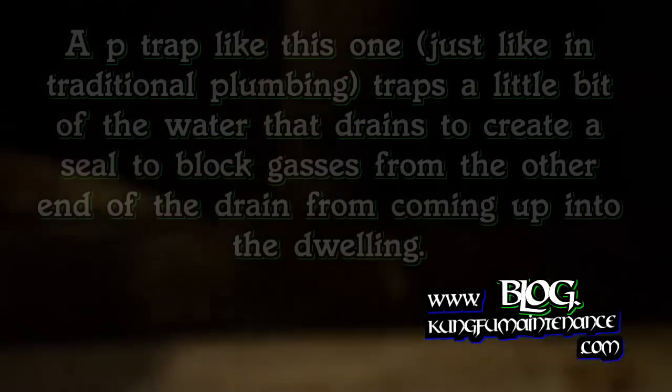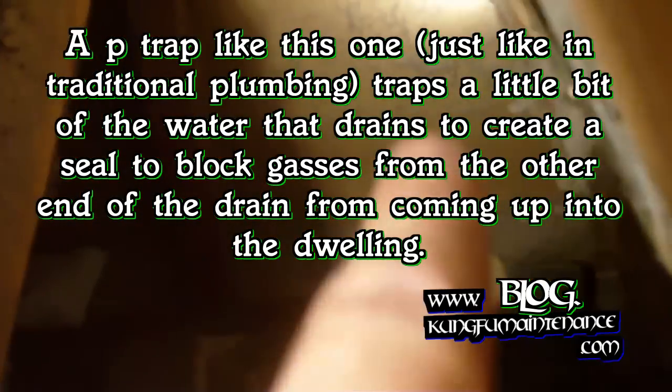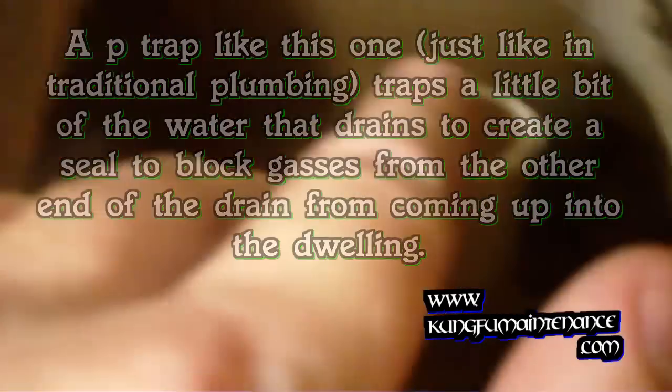Here's the condensate drain. What it has is a vent in the condensate drain. So the entire drain line goes out back — there's a trap right behind here, right before the vent. And so what we can do is vacuum from the vent or vacuum from outside. If the water was overflowing right here, we'd actually want to vacuum from outside. My particular setup drains into a gravel well. Because our clog is right here at the drain, it's either at the drain or it's in the trap there — most likely in the trap.